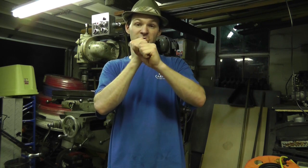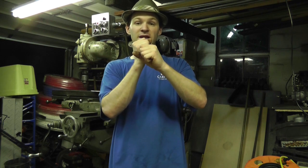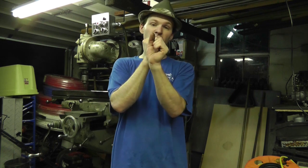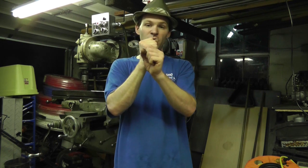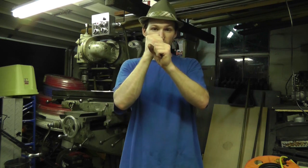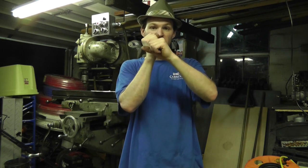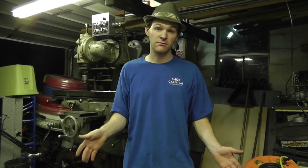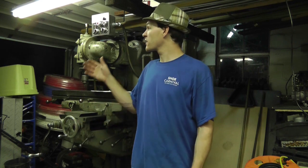So if the motor starts turning this way, the encoder is going to go with it, and it's going to say, okay, feed me voltage and current to make the motor go this way and hold my position. I don't want it to move. But what I've done is I'm turning the encoder, and the drive is trying to turn the motor the other way. So I'm feeding it a signal, and the motor is actually just sitting there. But it thinks it's trying to fight the other direction.